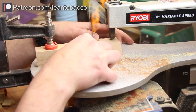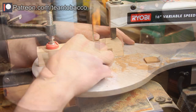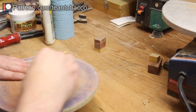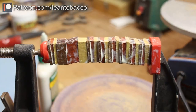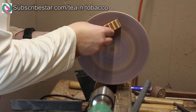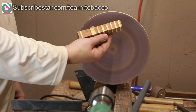The first thing I had to do was take strips of one-by-one of each of the woods I was using and cut little segments out — just little flat pieces. Then I had to sand them so they were perfectly flat because the scroll saw was a little off kilter. Then I did a glue-up. Obviously it's not the prettiest glue-up in the world, but it gets the job done. Then I sanded the glue-up flat after it was dry so it would be a little more square.